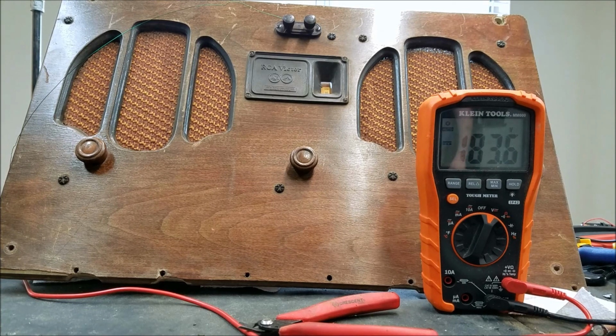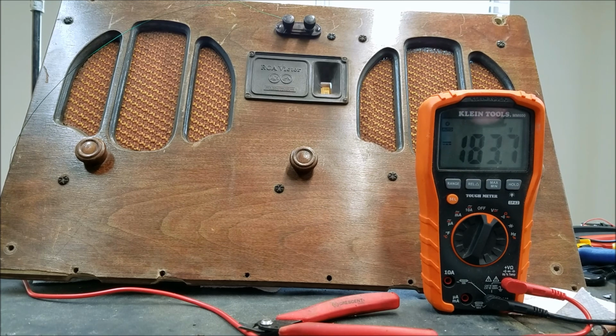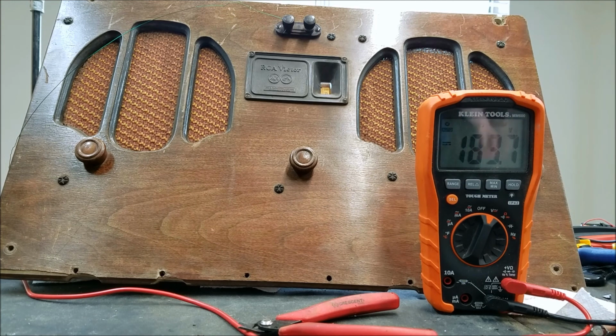To the resistors, I think there's only 4 or 5 original resistors left in here. They checked out okay. The resistors I took out, most of them actually tested on the low end, which is kind of weird because usually resistors drift up over time. But there were a couple that were at least 50% high, so some that were even double their value.